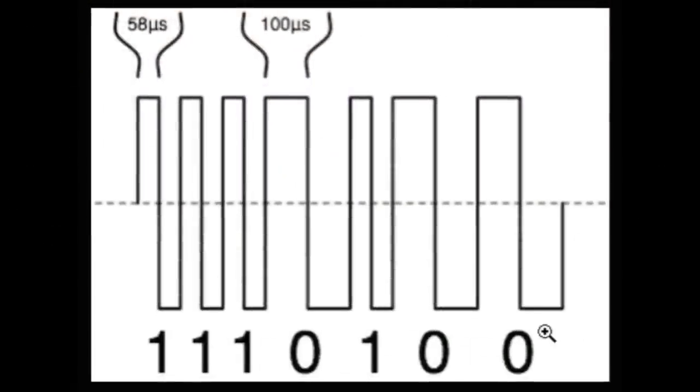This is a depiction of the DCC signal that is occurring on your track. I want to point out the importance of this and the difference between DCC power and DC, because it is very, very different. With DC, you just have electrons running out to the track and coming back on the other rail after they do their job turning the motor or running a light bulb. With DCC, it's a bit different. Let's say this is the left rail and this down here is the right rail. At any given point in time, first one rail will be on and then it will go off — this is a zero point of reference — and then the right rail would have the power on and that will go off, and then the left rail and right, and so on. It just keeps alternating back and forth.